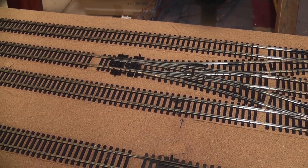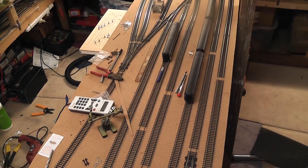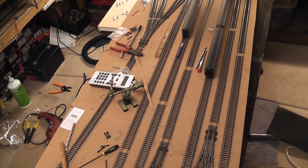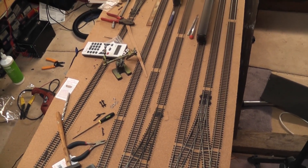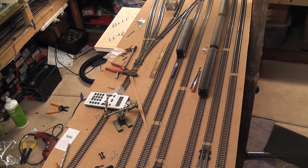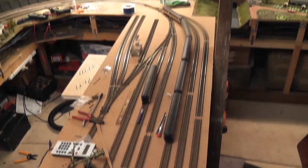I think a rectangular magnet of that sort of size would give a little bit more margin for error - you have to get the bottoms of the KDs in just the right spot for maximum swing and then they uncouple quite nicely. If we have a longer magnet the window of opportunity is going to be greater and you should be able to uncouple a little bit more reliably. So that's the end of part five - got the control panel installed, started to tidy up some of the wiring, and most of the motors are now in. I'm going to order some different magnets - they're very cheap so it doesn't cost much to test them out - and I also need to adjust some of the point motors and install additional point motors down that end. When we come back it should just be a few loose ends with the electrical side of things to tidy up, and then we can start thinking about scenery and start to build up the model on the table.